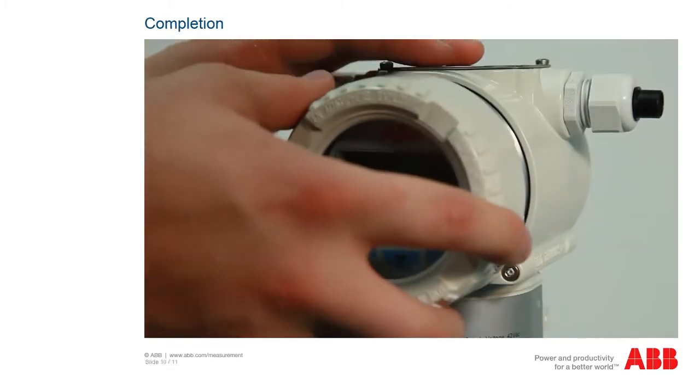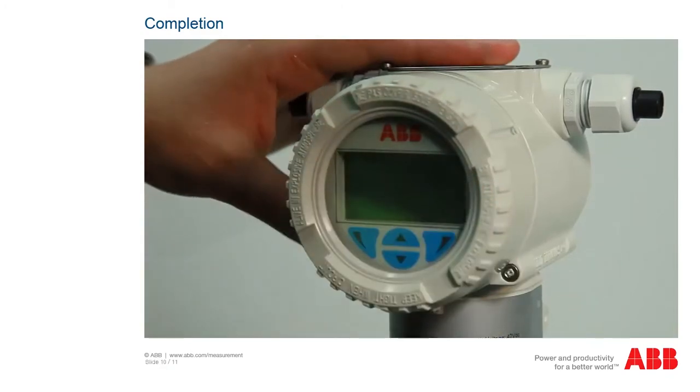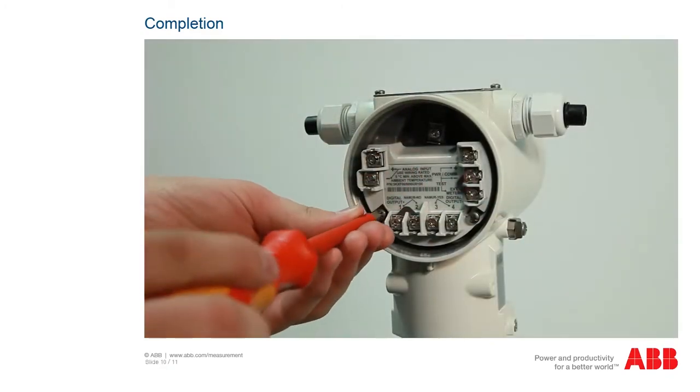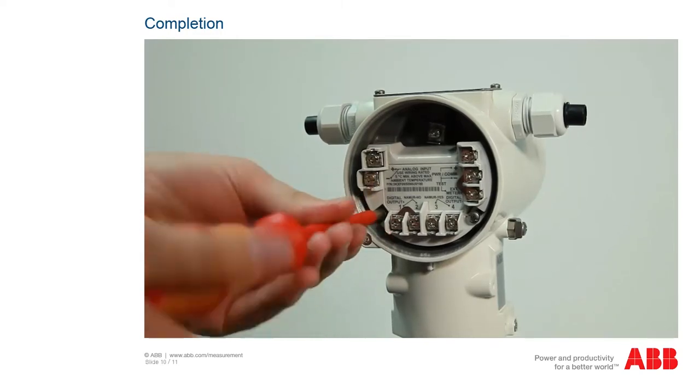The connector panel is then installed on the rear. Insert this carefully without damaging the contacts in the housing and screw the connector panel into position using the 2 Phillips head screws.